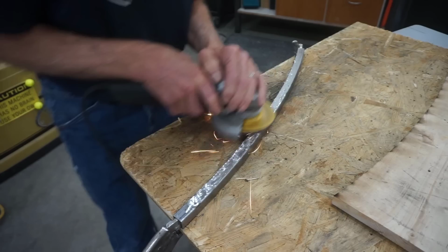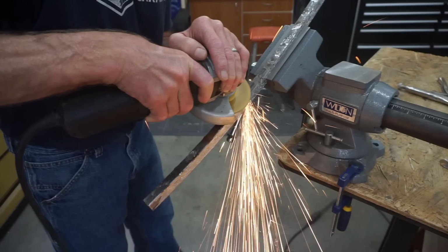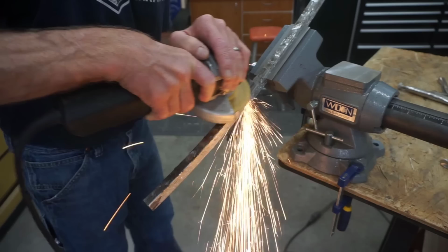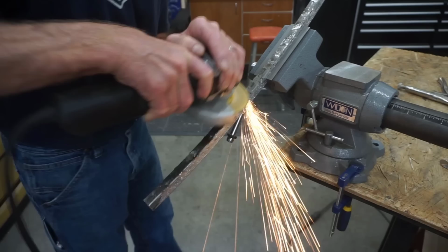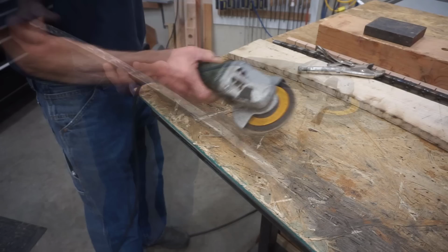And this process clearly demonstrates why I'm a much more accomplished grinder than welder. But with an acceptably few minutes of grinding, I've got one side of the tube all cleaned up, so I can proceed to the other side and finish up with the welds on the inside radius of this tube. After I finish grinding the last few welds on the inside radius of the tube, I take a quick pass along the corners to remove little tidbits of weld there, and then switch to the 80 grit flap disc to clean up grinder marks and make the piece fit for finishing.